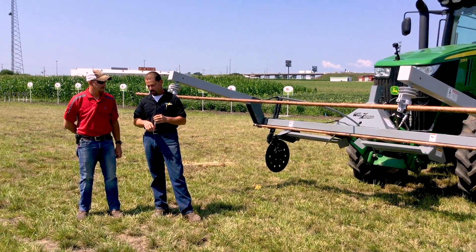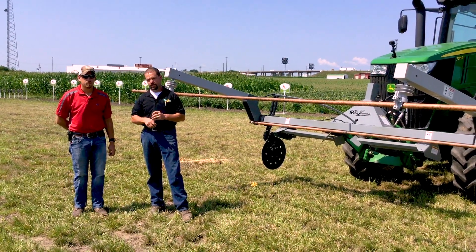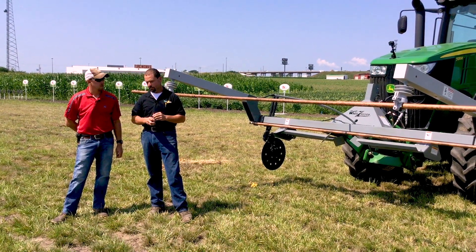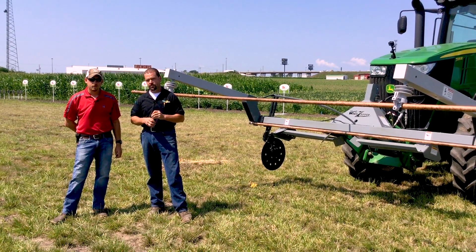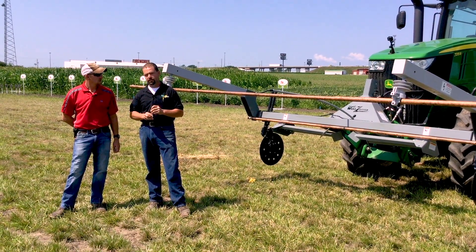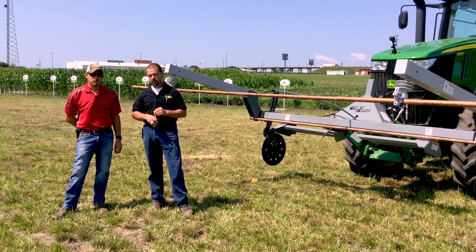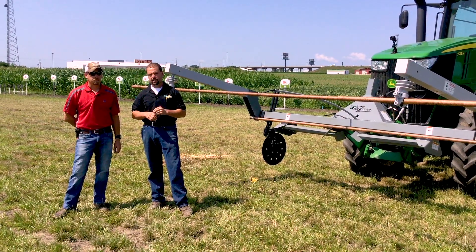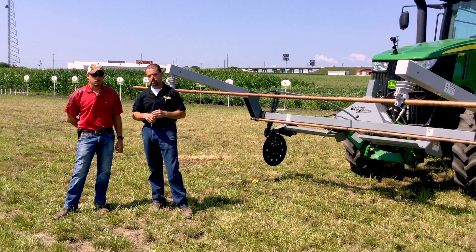It will go typically, depending on ground moisture, about four to five inches deep into the root system. This system proves to be very effective on anything that conducts electricity well. Typically more woody-type plants such as small trees and saplings are not affected as well, and even late stages of velvet leaf or late stages of foxtail when that stem has started drying down — it's typically a tougher situation for the machine.